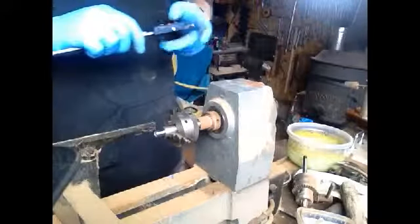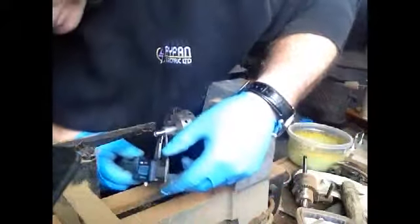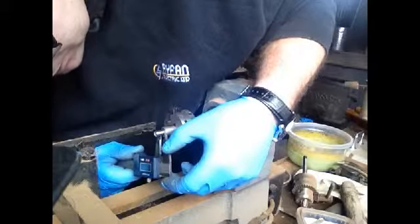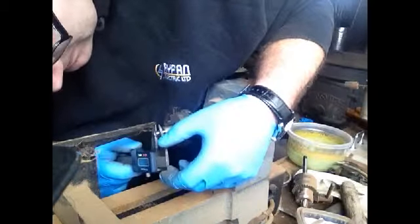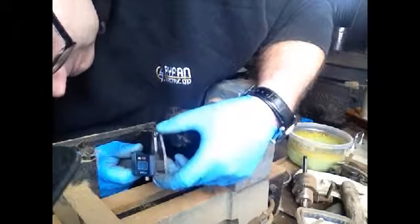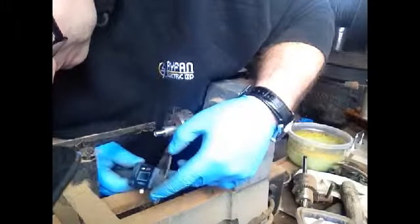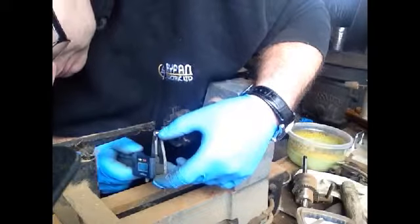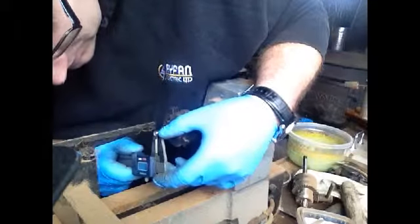I'll give this a little measure. I took a little bit off — it's at .319 up there, but we dropped down and it's staying right at .319. I may not have had my caliper zeroed the first time I did this, because I had it down to .308 or .309 — still at .309 and .310.